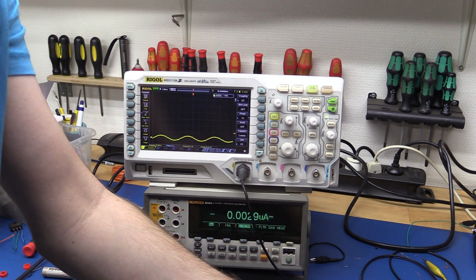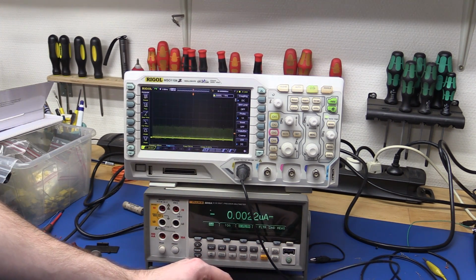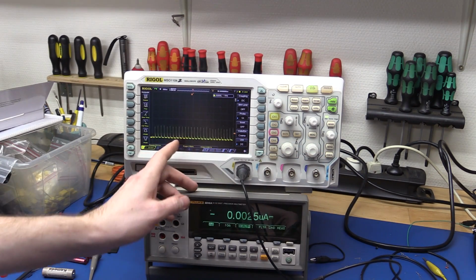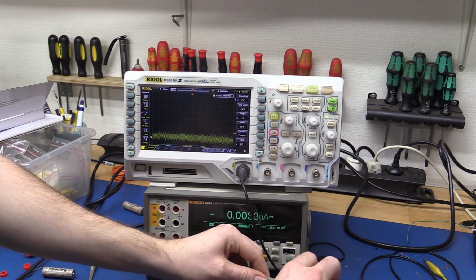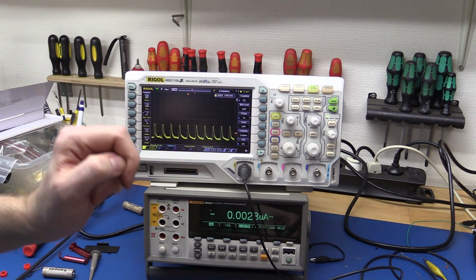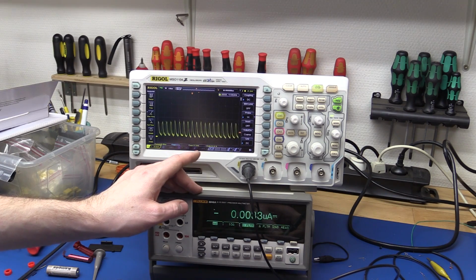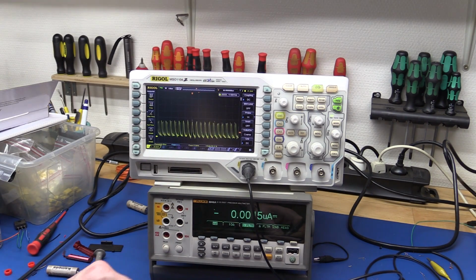Let's drop it a little bit further, now 470 ohm. Should be pulling around 3 milliamps. Still looks like pulse frequency modulation to me. Now I'm using a 220 ohm resistor. Well, maybe still pulse frequency, or just a very bad oscillator and a short duty cycle, but here at 100 ohm we should be drawing 15 milliamps, but it still looks like the frequency goes up.